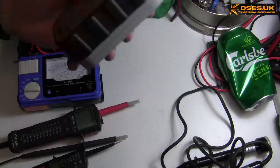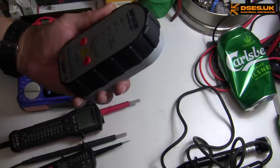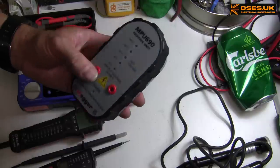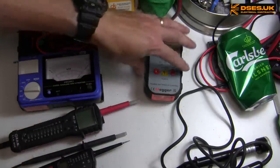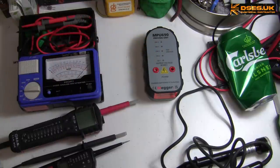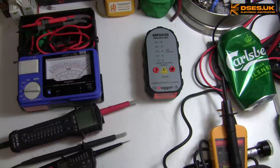I assume in this thing we have something to invert the DC to AC, then a transformer to ramp it up. I wonder if it's charging a capacitor too. Old people like me will remember the xenon camera flashes that used to emit a high-pitched whine as they charged up. So maybe that's what we have here. I wonder too, if it is a capacitor, then a capacitor discharging might explain the quick drop-off at the lower voltages. If that's the case, this isn't really a stepped output as the box claims, more a deteriorating output as it discharges across the instrument under test.